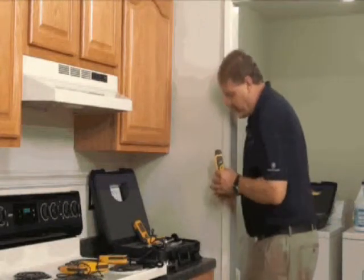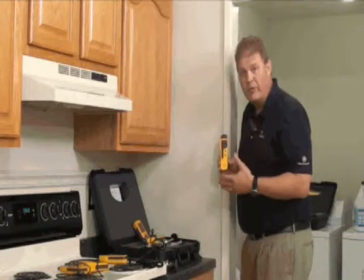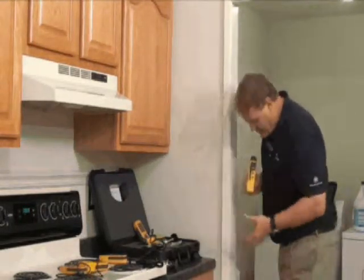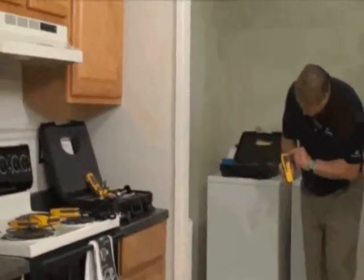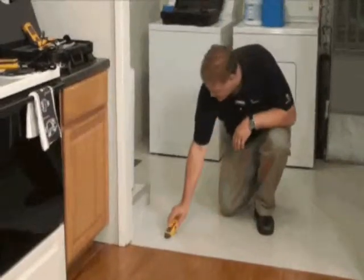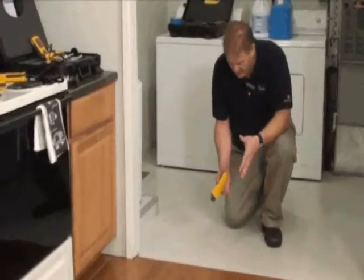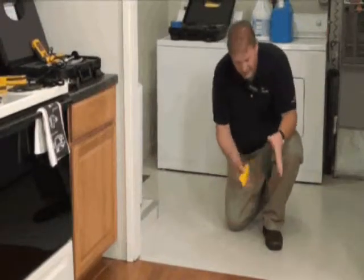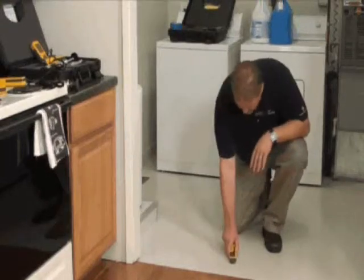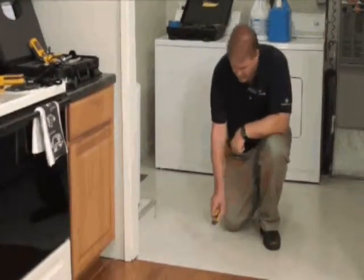The Surveymaster is also useful for looking for moisture below floor and wall coverings, such as ceramic tiles or vinyl floors. In non-invasive mode, this allows you to quickly scan an area of vinyl tile. It doesn't look like there's any moisture on the surface here, but quite easily there could be moisture below the surface in the subfloor. You just move the meter from area to area, looking for high areas of moisture content.